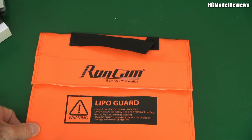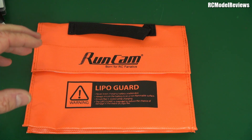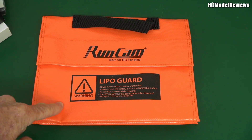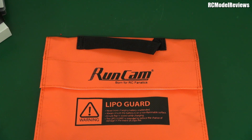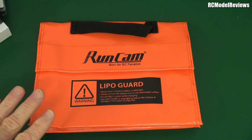It'd make a spectacular video, but most people get these bags and just assume it's a lipo bag and they're safe. Well, it's not really true, because when a lipo goes it vents a lot of gas — usually hydrogen gas — the gas ignites and the flames have to go somewhere. This won't stop the flames, it'll just direct them. The hot gases have to come out somewhere, and when they come out, how far will they go? A lot of people use ammo boxes and say just drill a couple of holes, but have you seen what happens when a lipo goes off in an ammo box with a couple of holes? The flames shoot out many many feet. Also, if you put all your lipos in one bag and just one goes off, they're all going to go off.